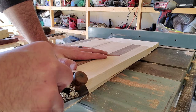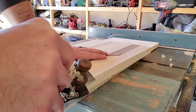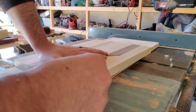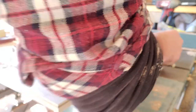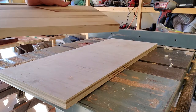For the final shaping, I sent mine off to be planed because I don't have a planer. You can do it with a block plane, hand plane, or jack plane — or you can take a ruler and a sander, use the ruler to shine a flashlight behind it to see the high and low spots, mark them, and sand until it is completely flush. It's not particularly easy but it is completely doable.